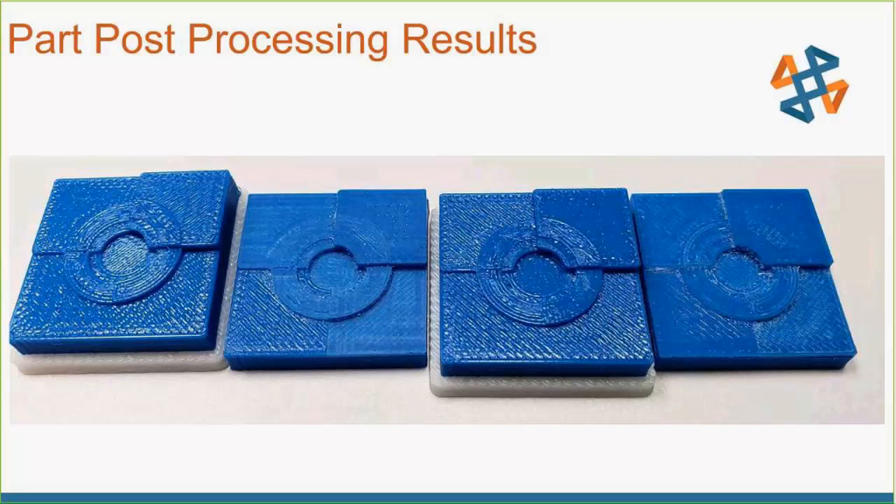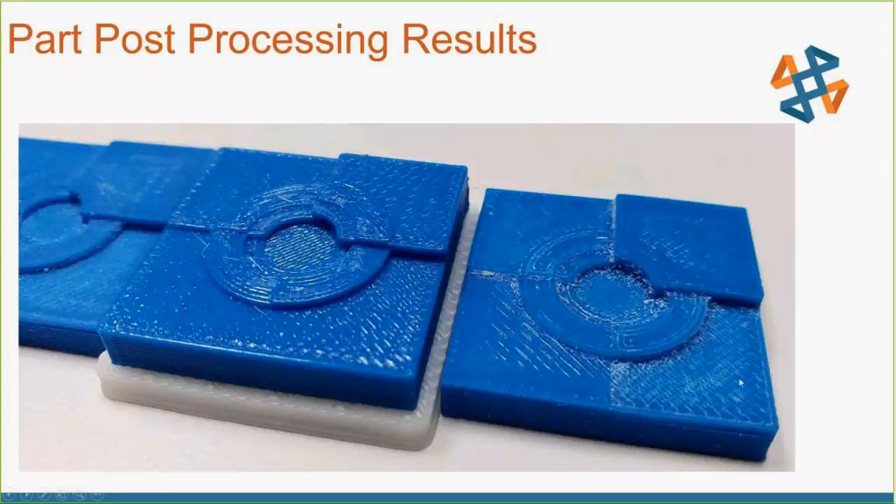There are still a little bit of striations left over here, but about 90% of this part is polished — with a nice clear coat it'll be done. It also interestingly brings out the coloration in the filament strands and how dyes aren't equally distributed in some prints; you can see how layers go down and become slightly see-through when you cut one in half. These finishes were achieved using a one-sixteenth-inch flat square end mill, about 20 minutes per unit to process.